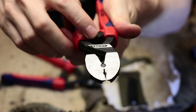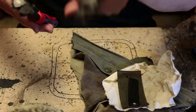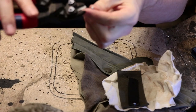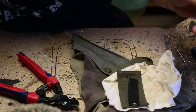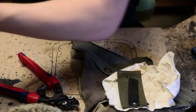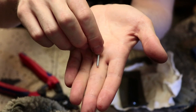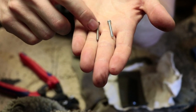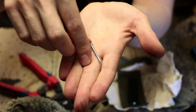I keep the broken pair around as a testing piece — if I have some unknown metals I want to cut, I'll use these first before my good ones to see if the metal is soft enough. While they are not primarily rated for steel, for me it works really fine with softer steel bolts. Some other bolts I have are from a harder, higher quality steel. Here I have my soft bolts, galvanized with zinc to prevent corrosion. Cutting the harder ones ruined my cutters; cutting these soft ones seems to be fine so far.